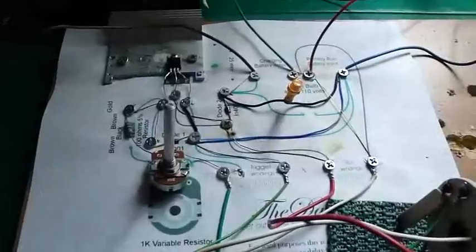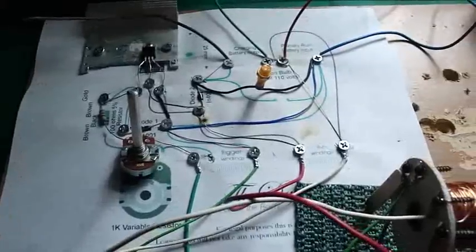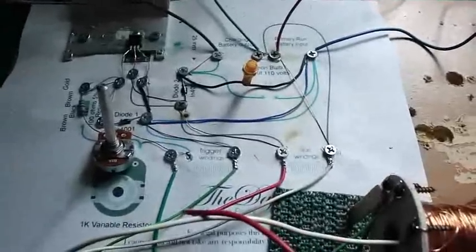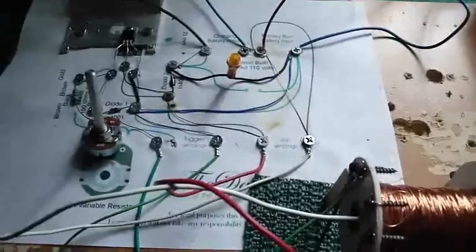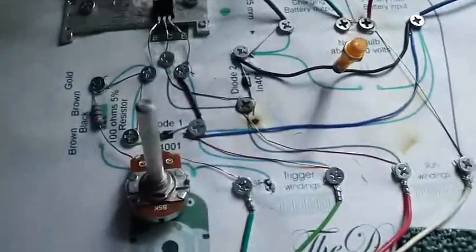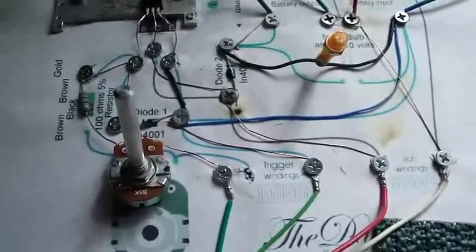I'm using a 10 ohm resistor in place of a 100 ohm resistor. And since our local Radio Shack only has a 5k pot, I have to use that. The rest of the circuit is exactly the same, other than I just grabbed a couple diodes — I don't even know what the numbers are on them. I don't think they're the 4001 and the 4007; I think they're like 4004s.